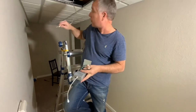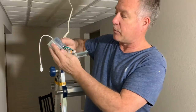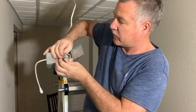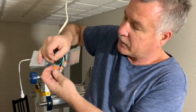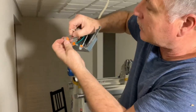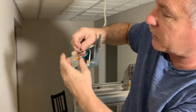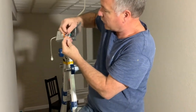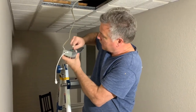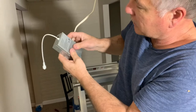Here are the three wires that are coming out of the ceiling. We're going to put this through here. Make sure that you have your power off and your breaker off — your switch off or whatever. These are really easy to connect; they make this really easy on this particular installation. These wires here, you just push them right in and it's there to stay. You just push each one right in and it grips on it and keeps it in there for you. Then just fold them up neatly, put them inside the box, and close it up and you're done.